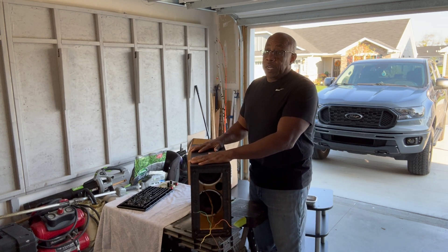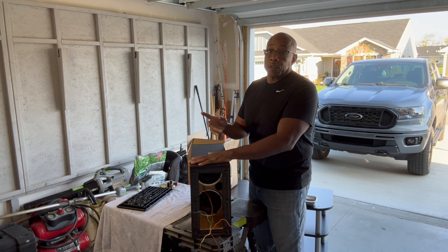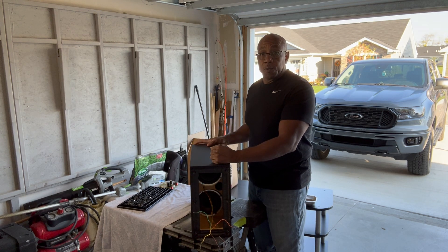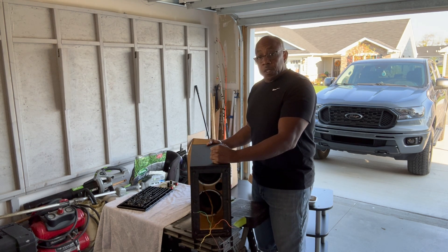The plate amp I have will go down to four ohms. So if I parallel these two speakers it will go down to three ohms, and I didn't want to take a chance of messing up my amp. So I actually ordered a couple of replacement speakers to go in here.